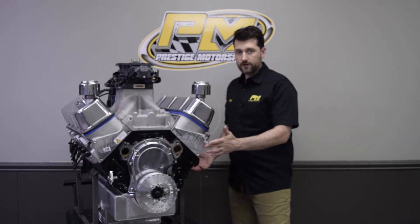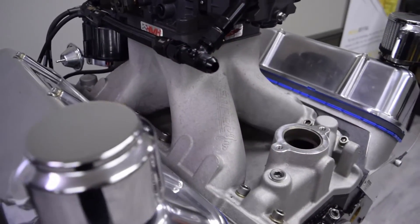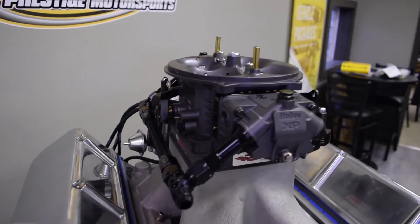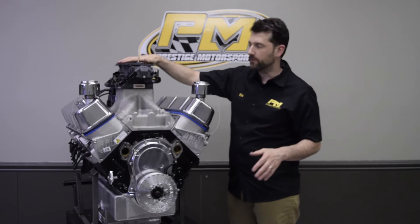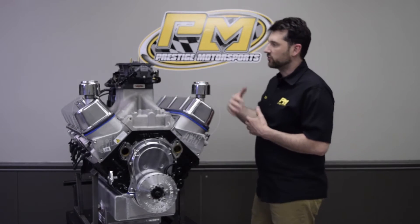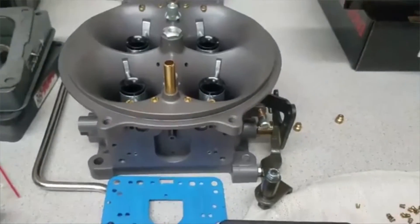On top, we have a set of AFR cylinder heads. These are CNC ported to handle the big cubic inches of this 632. We have a single-plane aluminum manifold, and then a Holley Dominator on top — this is a 1050. One thing about this particular carburetor: designing it for the conditions this engine will operate in, this carburetor is built for a street/strip, wide-open-throttle application. We had to do a lot of adjustments and tuning to get it to perform where we needed to. We've changed everything from main jets to air bleeds to modifying the emulsion tubes. Lots of work and development goes into making these carburetors run well in an airboat application.